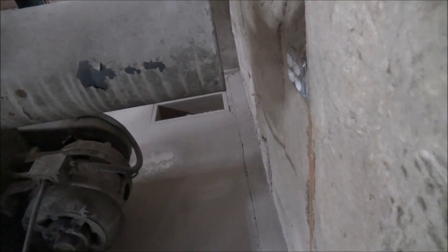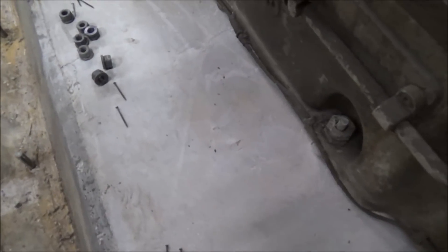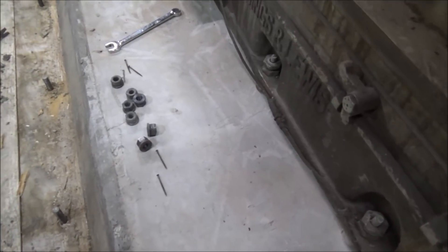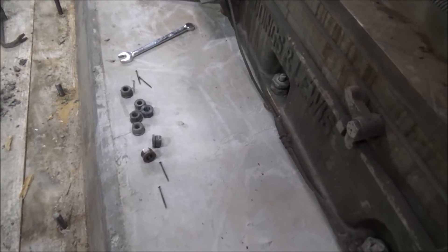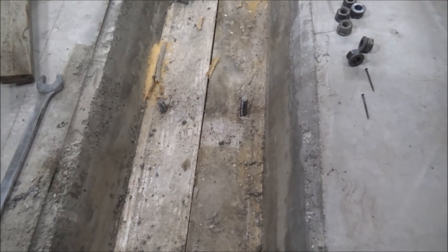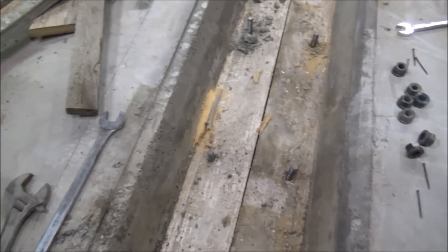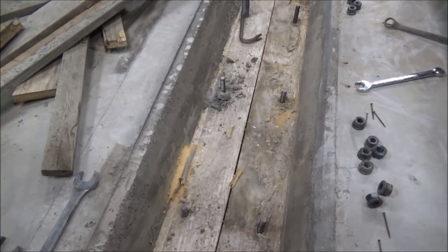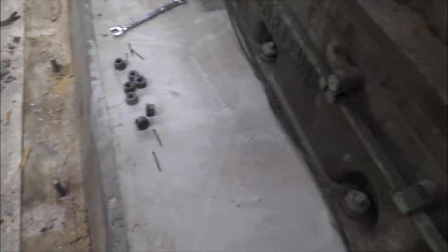You can see I've got a little clearance back here for the end of the ram, so everything can fit in there nice. You can see the anchor studs. I haven't bolted this down because I'm going to wind up picking it back up. I've decided I'm going to put epoxy down underneath this machine, especially in these pits, to keep coolant and stuff from sinking into my concrete.